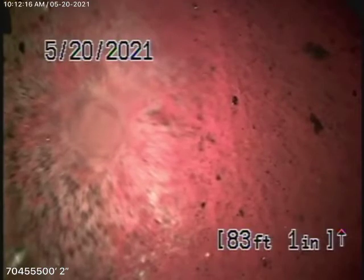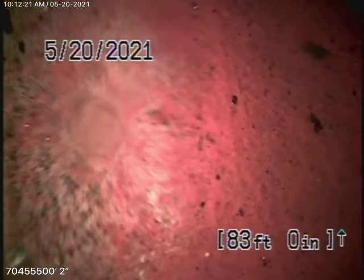The clean-out on the left by the garage is for the laundry room. We're running the camera out and we're all the way out to the city connection. There's the city sewer right there — your connection to the city. We're going to bring the camera back. It's a six-inch clay lateral coming back from the middle of the street towards the property.